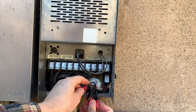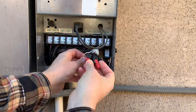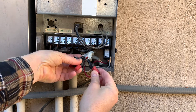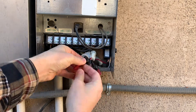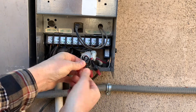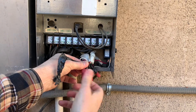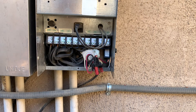I'm going to replace that switch. There's plenty of wires in here. Two blacks go to this cap, two reds go to the middle one, and two whites go to the far one. It's going to be a matter of removing this nasty tape and replacing wire for wire.